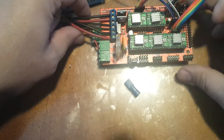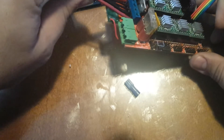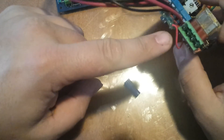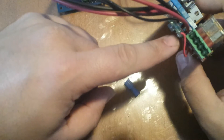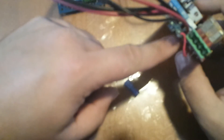So that should help your RAMPS 24-volt conversion out and make it a little bit easier between the fuses and the step-down. There is a Thingiverse mount for this, but with my printer being down at the moment I can't print one out. So I just hot glued the whole entire back side of it to give it some protection and to hold it in place for right now.